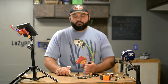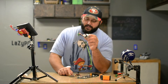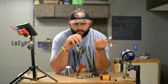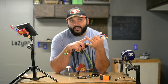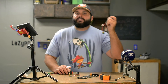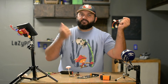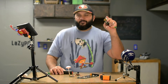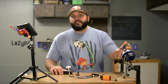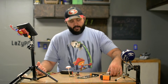Today we're having an experiment. We're going to plug in a 3S battery and run it for about 10 minutes to see how hot the VTX gets, then do the same with a 4S battery. A 3S battery is 11.1 volts, and most VTXs run off a 12V BEC or 5V, so I'm concerned that plugging 14 volts from a 4S gives it more power to dissipate, compounding the heating problem. The end question: will 4S batteries shorten the life of your VTX on the Racer 250, and can a heat sink extend its life at the expense of three extra grams?